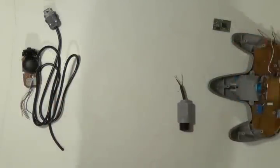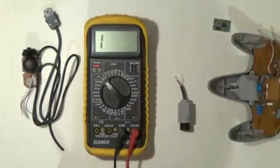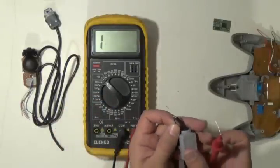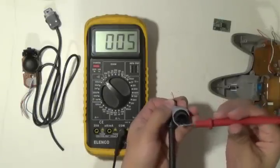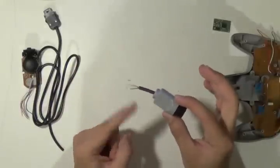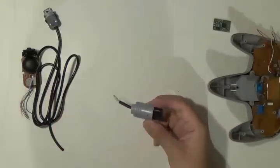Now that you have all those wires stripped, you can get the multimeter out and put it on the continuity test. I've got probes that will reach, and you can see the number change. Let's see which one of these represents ground — it's not that one. It's this one, the one on the side, not the one in the middle. This is one way of doing it without having to break or take apart the connector. As you can see, we can find each one and what it represents so we know where it goes, and that will help us in the schematic later on.